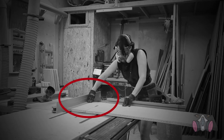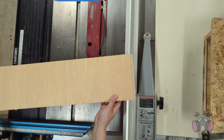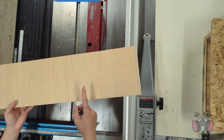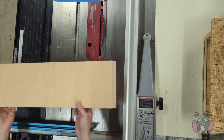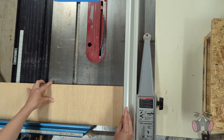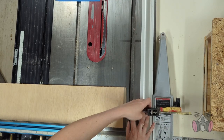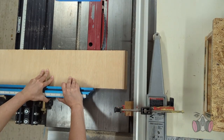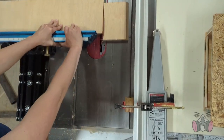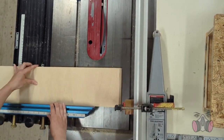The issue was that I had to push both the sled and the piece on the other side, because once it was cut, it would shoot back if I didn't push it physically. So what is the proper way to do this? If you want to make a bunch of cuts of identical length but can't use the fence, does that mean you have to re-measure each time? Luckily, no. You can solve this by setting up a buffer — clamp a piece to the side of the fence and set it up so the distance from it to the blade is the length of cut you want. Run the pieces up to the block, and once you hit it, you know that's your distance, then push the sled forward. Because the fence isn't so close to the blade, the pieces just get pushed away and don't cause a problem.